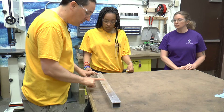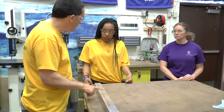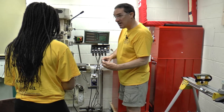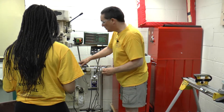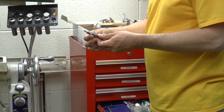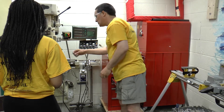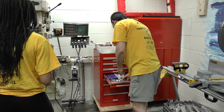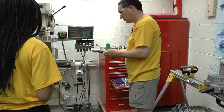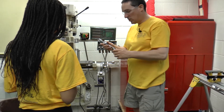When we do this on the milling machine, we're going to put the bearing diameter holes in using a certain set of tools. This is our half inch collet — you can see it says half inch on the end of it, and that's the one we're going to install. First we use a half inch diameter center drill to locate the hole. Then we use this big bearing drill bit to drill the bearing hole, which has a half inch shank so it fits in the same collet.